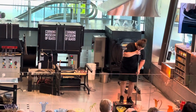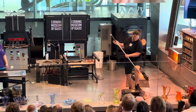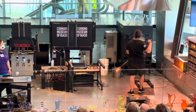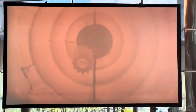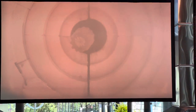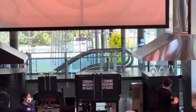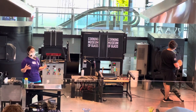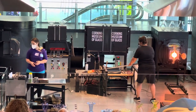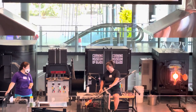Over here we have some optic molds — and we have a nice view of them as we inflate the bubble within them. You get a really good view of the texture as we go in for that reheat. The cold metal of those optic molds freezes the texture into the surface of the bubble. We rely on a good, strong core heat to be able to further inflate the glass — we don't want to heat it up too much because it would soften and melt out the texture we took the time to create.